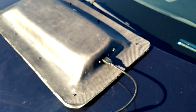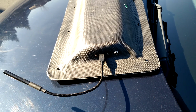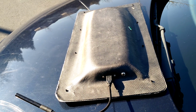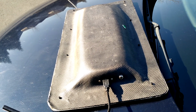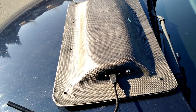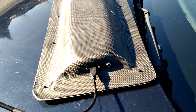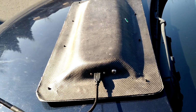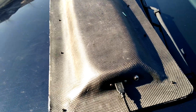The reason why there's two is because the supercapacitors have very low resistance. They'll suck up any amount of electricity you can feed it. So that's really good for a solar situation, but even more important in a portable solar panel, because this is going to be moving underneath trees and clouds are going to be rolling over, and the supercapacitors will charge up really fast and then they'll release really slowly into the 8,000 milliamp battery. So it'll kind of keep it charging. Like right now it's charging even though it's not even facing the sun, because I powered up my supercapacitors already.